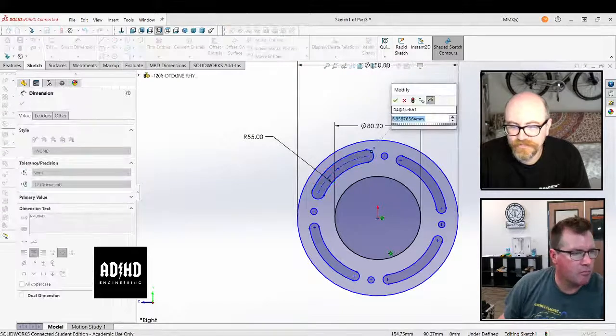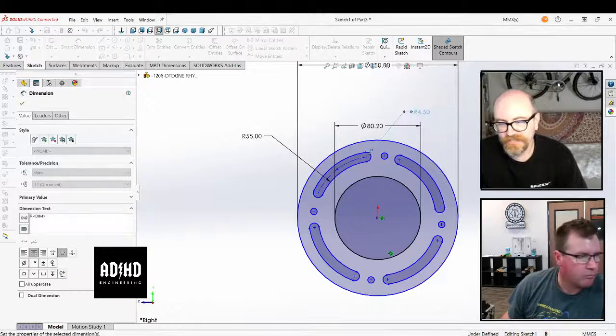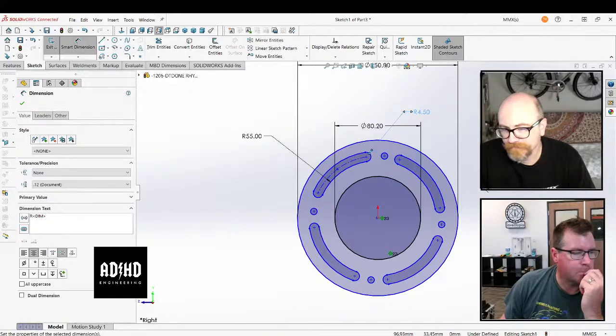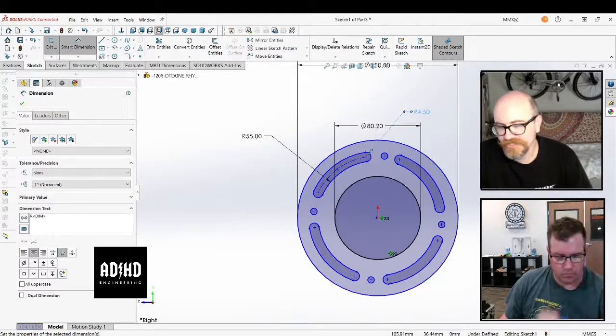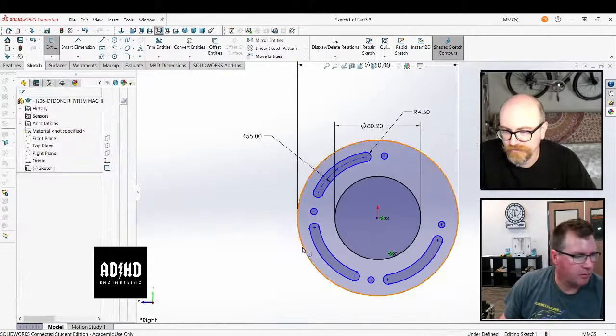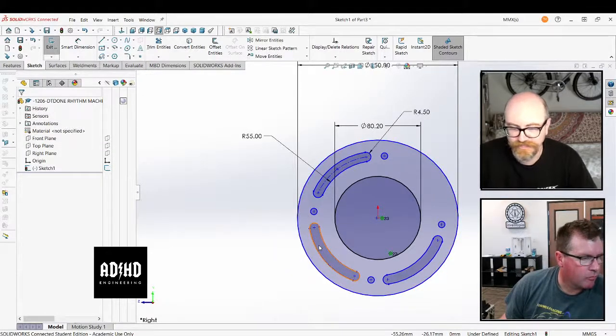You're bringing up another topic, though. Look what you're doing right now. You're making a real slot. Look at the thing next to it. That's not a real slot. There's no center line, so SolidWorks didn't recognize that as a slot. It just looks at it as two arcs connected by two half circles. But that's just going to be some work that needs to be done.